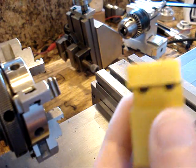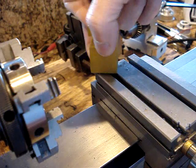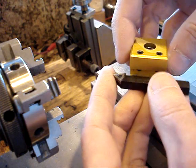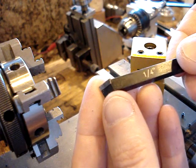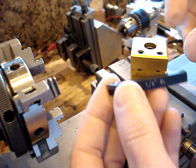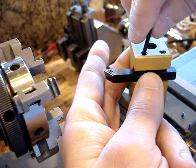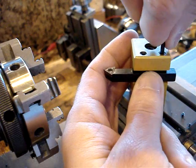You just slide this in. Now you may not have the T-slot on your cross slide — I'll look at your video in a minute. And here's one of the little carbide indexable ones that I got off eBay — I think you get four or five for 20 bucks or something. You just put it in with two set screws and a little Allen wrench.